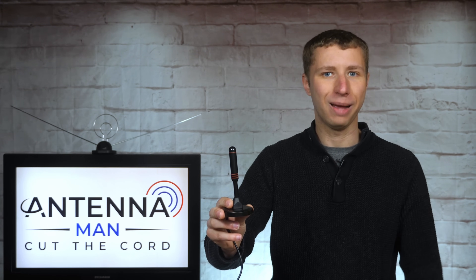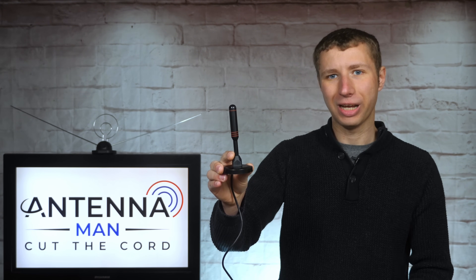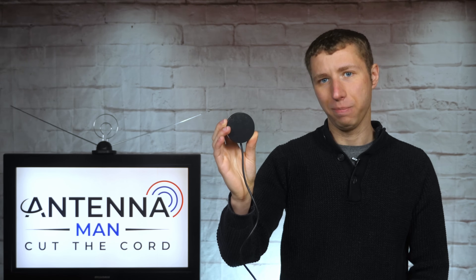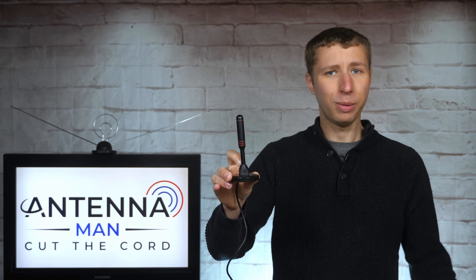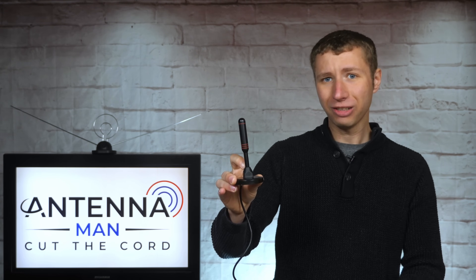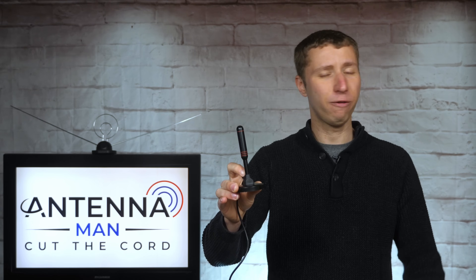So back to this antenna. The design is incredibly basic — it's a very small, short antenna that appears to be only good for UHF. Remember that you typically need a longer antenna element for VHF channels 7 through 13, like a set of rabbit ears. One thing that's cool about this antenna is that it has a magnetic base, so it can be stuck on a metal object or window frame and won't fall down. But that's about it in terms of features. I'm really surprised to see an antenna like this marketed for a home TV set rather than a portable TV.